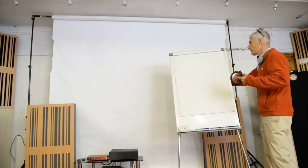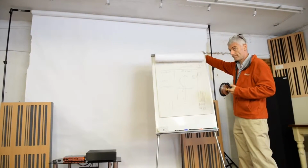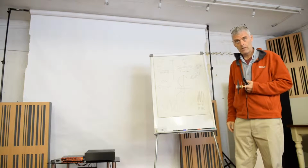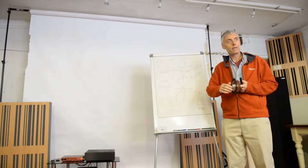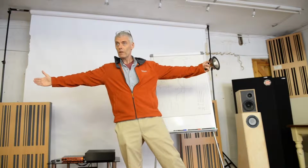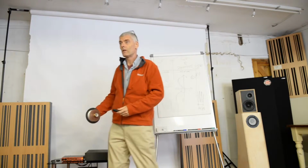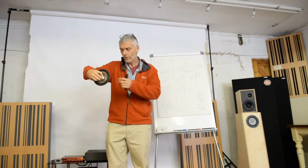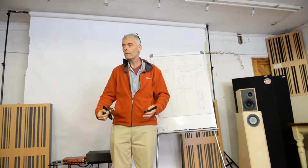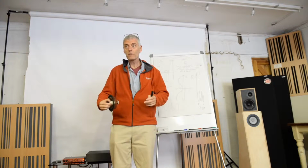And full range drivers, going back to my first slide, traditionally, because you only had a few watts from your whacking great tube amp, didn't do an awful lot in the low range end. If you look at some very old designs on the internet, type in Lowther or Fostex designs, what you'll find is these huge speaker boxes, these massive things that maybe your grandfathers had, and then the speaker in the middle. They are basically expansion boxes where they're trying to expand the very, very tiny amount of oscillation coming off that driver, to create a low wave effect, expand that wave, allow it to drop the frequency, and you'll get a bit of a bass sound. But to do it, you need a big box when you've got a traditional full range driver.